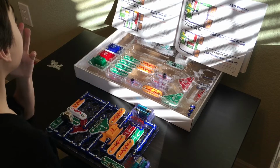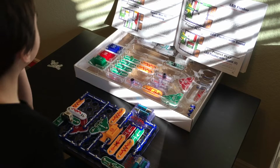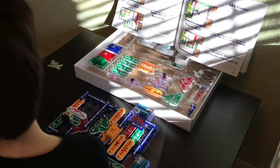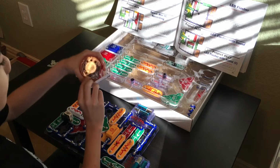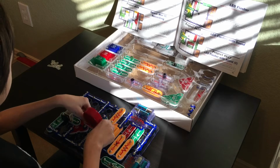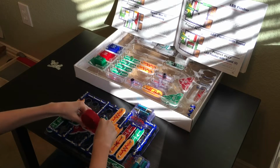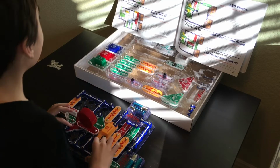I'm pretty sure. Okay, so let's go right on to all level 3 parts. That's going to include an SP speaker just like this. Orientation is critical. It's the red type, 8 ohm, 0.5 watts. So that's going to go between this 5 and the 3. Just like that. Alright, and now we're going to be having